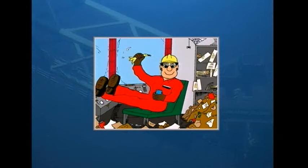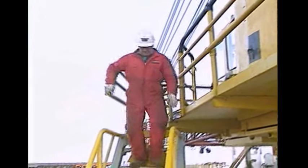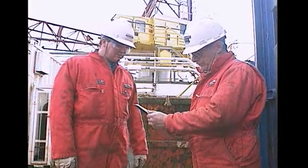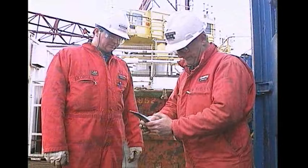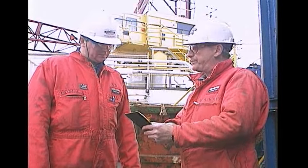At the end of your shift you're going to want a good rest, but before you go there's one last thing you'll have to do — the handover. Before you leave your crane, make sure it's safe to do so and that you've spoken to the next operator. Make sure the crane operator coming on shift knows exactly where you stand with any ongoing job, and don't forget to mention anything discussed at the pre-job meeting that he needs to know about. Tell him about any problems you've had and any maintenance that needs carrying out. You should also note any problems clearly in the crane logbook and report them to your supervisor.